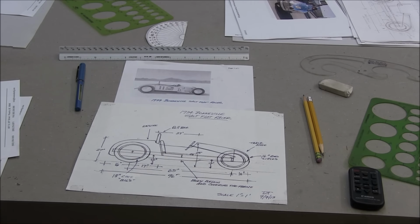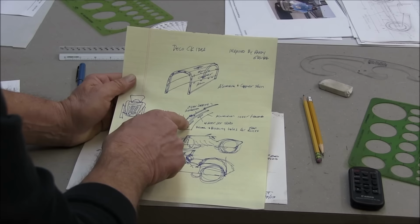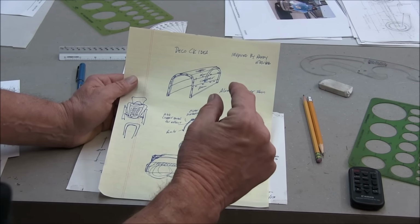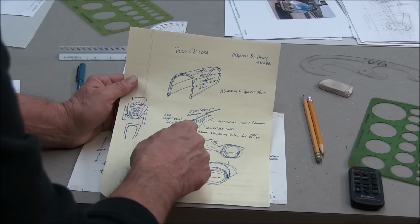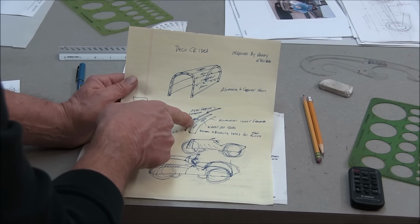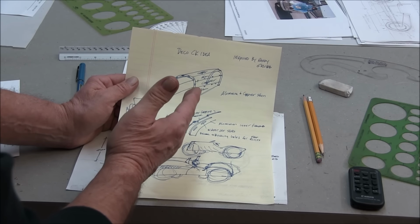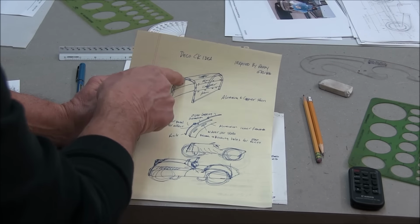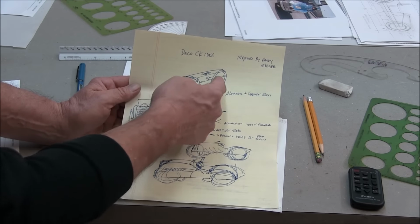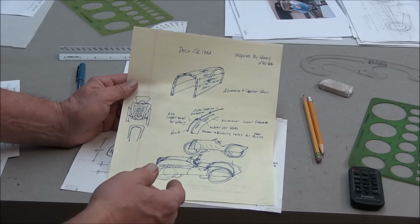Then I'm sitting at work one day and I'm sketching, and Randy Grub takes this aluminum, I think it's probably a half inch thick, and has it cut with a water jet, and he puts these slots in it, and that allows you to slip in a piece of steel to drive the rivet against the backing for the rivet. So the panel could be riveted to these hoops and layered like I'm talking, but you can see how it could be removable.